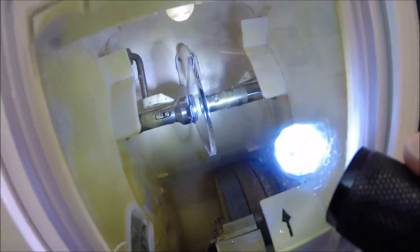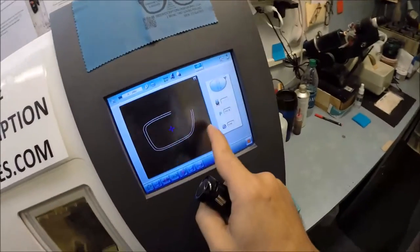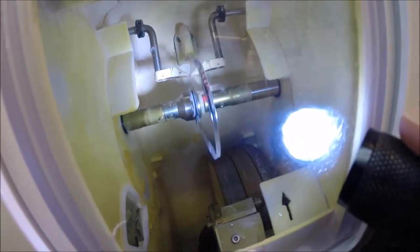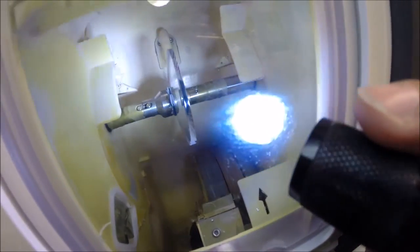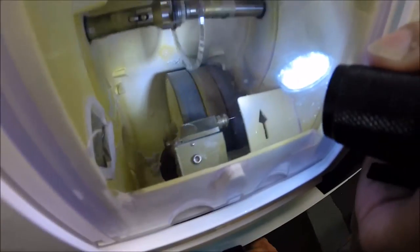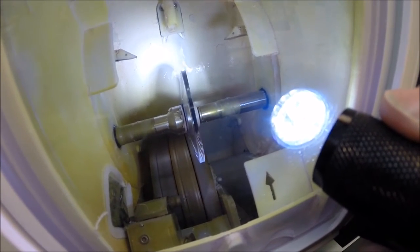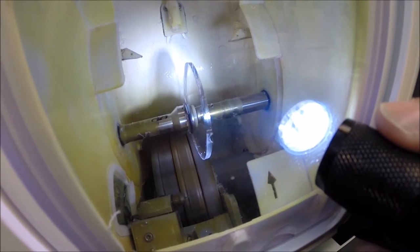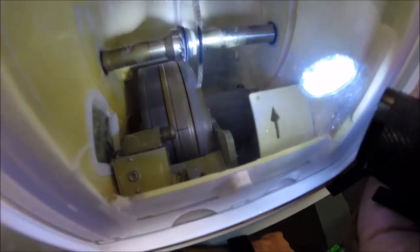I want a slight bevel on the front convex surface of the lens and a heavier bevel on the rear concave surface. I hit the green start button, the door closes, the clamp shuts, and then the lens is traced by two white styluses making sure it's large enough to fit into the frame. You can see it going around tracing. The old carpenter saying 'measure twice, cut once' applies — it's measuring the lens thickness at every point to know exactly where to cut the groove.